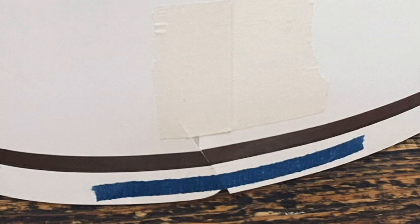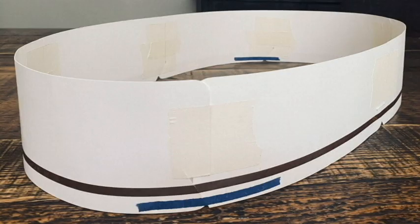I also added a few tape strips under the magnetic tape on the front just to make it smoother in parts because I made a large loop and I'll be running it through two machines at the same time, but this is not necessary. In this demo, I'll be using two machines to create a long delay effect.